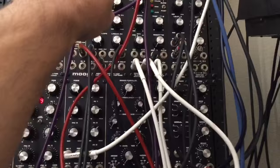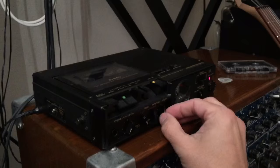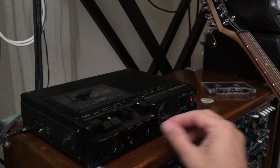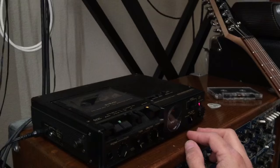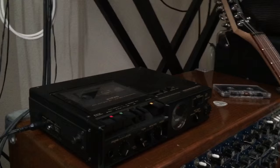You could technically use an EQ on a mixer to roll off the high end for the repeats, and probably do the same thing for the high pass frequency — so you don't need a modular synth. You just need some cables, this unit, and a basic modification inside to enable the pitch control to work while it's in record mode. That meant cutting one trace on the circuit board and wiring it to a separate point — one wire, one circuit trace cut. You can use it without that mod, but you can't change the pitch and you're locked to an echo rate, which is not desirable. If you have any questions, hit me up in the comments — thanks for stopping by.